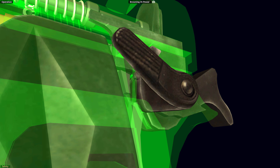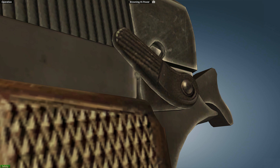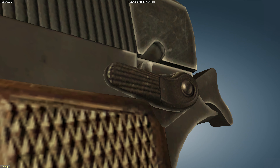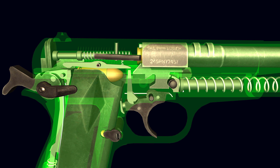When set to the manual safety catch, it blocks the sear and slide. Due to the fact that the sear lever is located in the slide, the firing mechanism will not work when the slide is not fully closed, which is an automatic safety device. The pistol is also equipped with an automatic magazine safety that blocks the trigger mechanism when there is no magazine in the pistol.